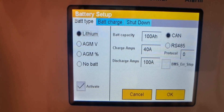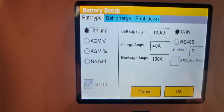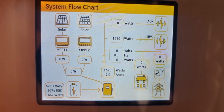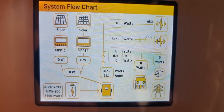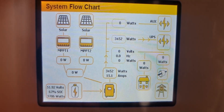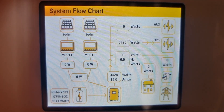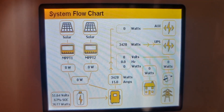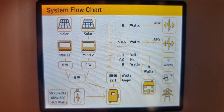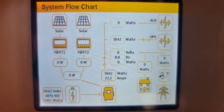So I changed it back to 100, and then we went back in after we'd got this all set up again. You'll see here the base load is 1.5 kilowatts. The client's gone into the kitchen and switched the kettle on — took it up to about three and a half — and then we wanted to see how close to five we could go. So he put the microwave on as well. There we go — just over five kilowatts. So it's happy.